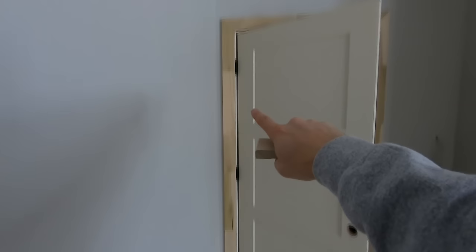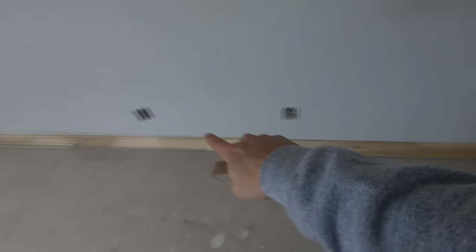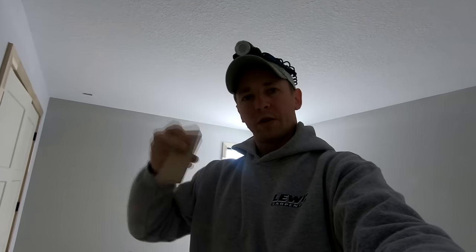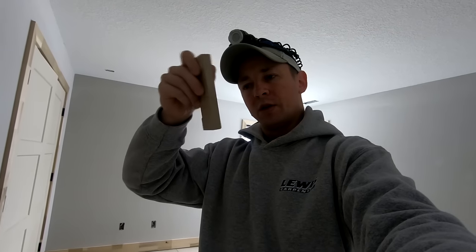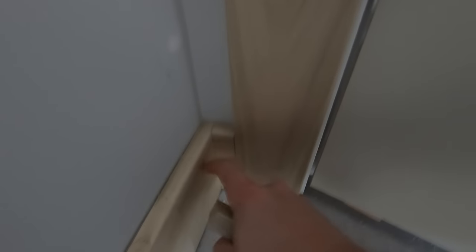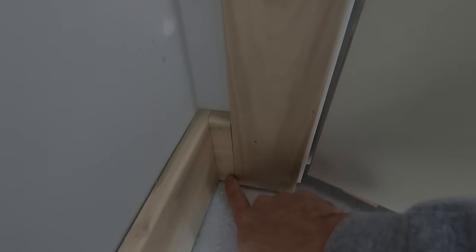Something I like to do — you're going to have this situation throughout the entire house where the door is off a wall and you have a narrow piece of baseboard. I always take the long piece and run that through first, then install the small piece. The reason is if you install the narrow piece first, the taper on the bottom of that piece of drywall is going to want to let the small piece kick in, and you'll end up with a gap. If you install the long piece first, if it's kicked in a little on the bottom it's not a big deal because you're riding up against it and it's going to be nice and tight.